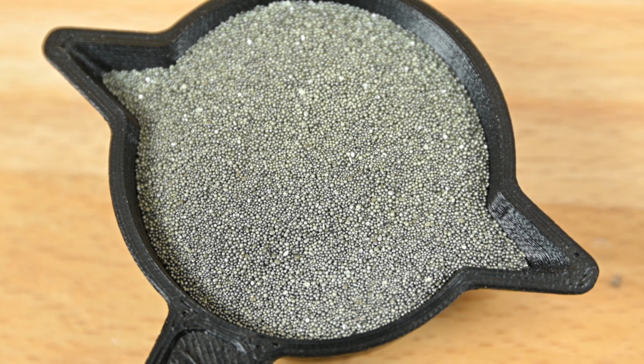The next upgrade people usually tend to go for is an annealer down the road. Annealing will extend your case life longevity and will prevent you from overworking brass, which, if you don't anneal, will eventually cause case failure, and the brass will no longer be able to be used.